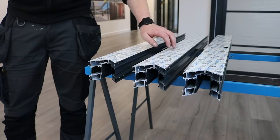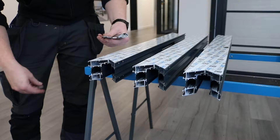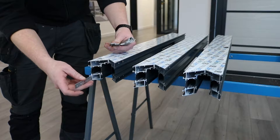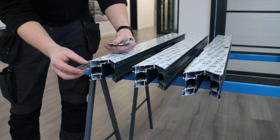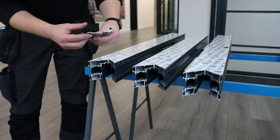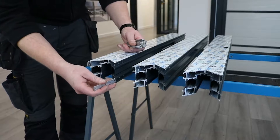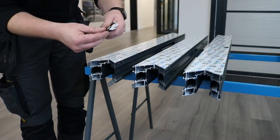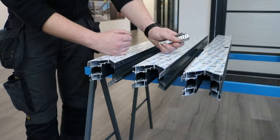When the doors are routed, place them in order and then we need to put the hinge plates in before we put the sashes together. Four hinge plates need to go on each side. For an open in door, start by putting four on the inside, and for an open out door, four on the outside of the door. This door isn't open out, therefore we follow this pattern. For opening out, this pattern would be opposite, and with any more doors just repeat the same pattern throughout.